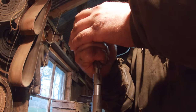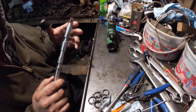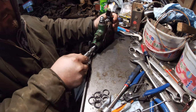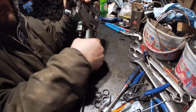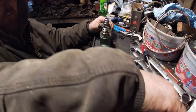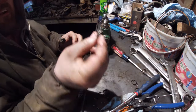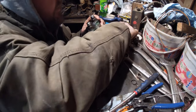It should have two detent positions — yes, there we go. Now we are finally ready to put the spool back in. Just ever so gently work it through the two new o-rings in there. Now I need to put it in the vise and tighten everything up. We should have a fully rebuilt valve and can go put it on the tractor. The last things are the little pin that engages the lever and the cap on the end.